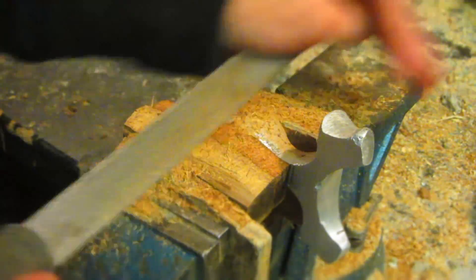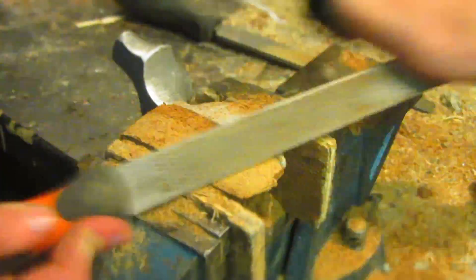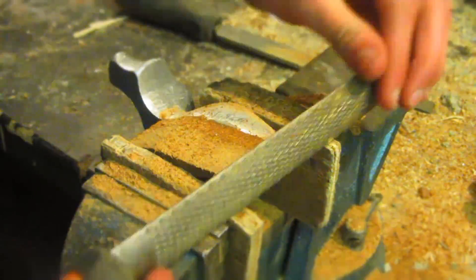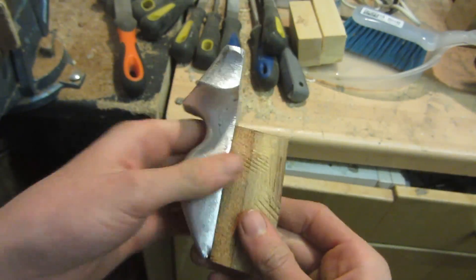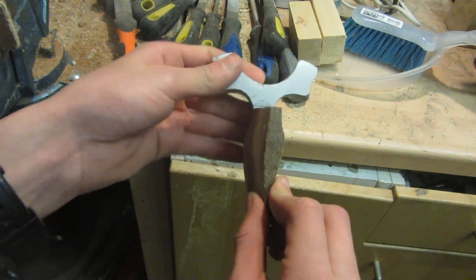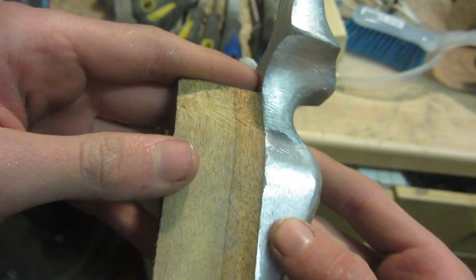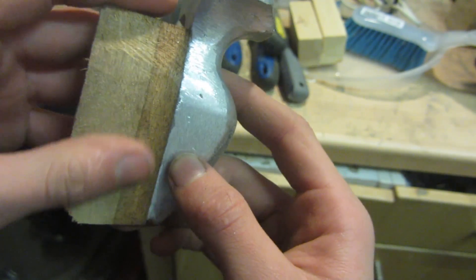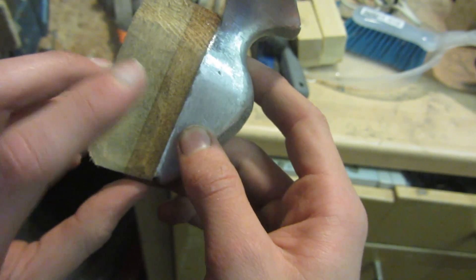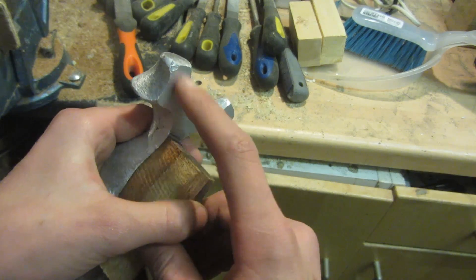For removing wood material quickly I like to use wood rasps. I make sure that I don't get them on the aluminium — even though some people say you can rasp aluminium because it's soft, I don't like to blunt my rasps. This is what it looks like once I've rasped it roughly into the outline profile. As you can see it just follows all the flat metal, and I've flattened it out on this side so you can see the grain. Once oiled there'll be a really nice contrast between the two pieces of wood and the metal. It's also got enough thickness, but I need to build up some more material up here.